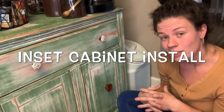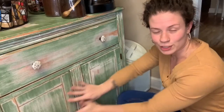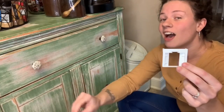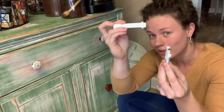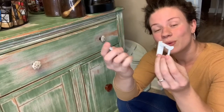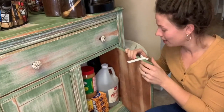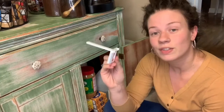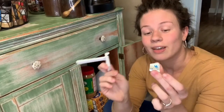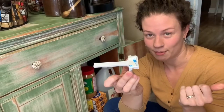Now let's take a look at how to install these safety locks into an inset cabinet — where the doors and drawer fronts are set into the face frame and everything is flush across the front. Take your cradle and the other installation tool, which is a ruler. With the flat side of the cradle facing towards the ruler, and with the side of the ruler that has numbers facing up, put the ruler into the cradle in that very top slot. Take your cradle and put the flat side on the outside or inside of your cabinet door and measure the thickness of the door with your ruler. My door here is just under two centimeters. Now, leaving the ruler in my cradle, take your strike plate with the adhesive side facing up and put it into the cradle just like we did on the overlay cabinets. Remove your adhesive cover.